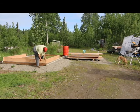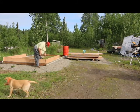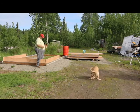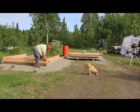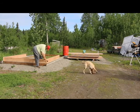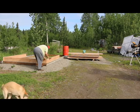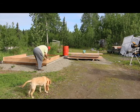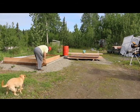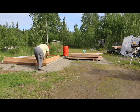The process is: get your gravel down first, then get the six-by-sixes in place leveled and squared up, then on top of that we start building the deck. You can see here I've been trimming off the ends of the boards, and of course Miss Lily just has to play with them — she's getting awful big but she's still just a puppy, born in October, only about eight months old. Getting the first board going on the corner is always the hardest because nothing is standing up by itself — you're trying to hold two or three boards at once, keep everything square, plumb, and true, and then get nails in it.